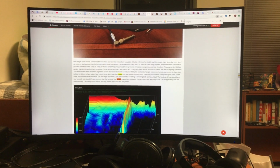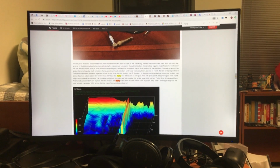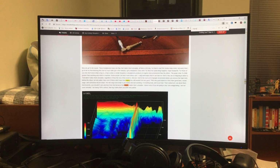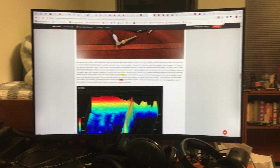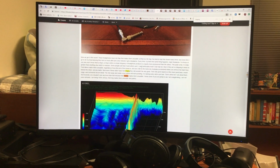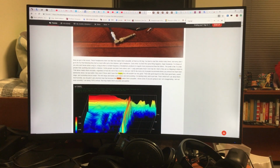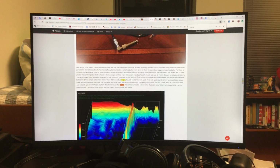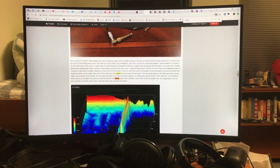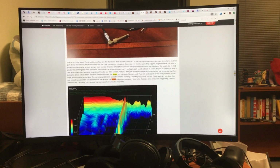This problem is very evident on HiFiMan's later offerings, like their HE400i, their HE400S, the Sundara, and the original HE400. Now, Audeze's LCD doesn't really exhibit this problem until they release the phaser model, which is the LCD-2 and LCD-3 phaser. Now, the phaser itself is not a problem, since it was released to correct the frequency overlap of the different segments of the driver, so that the frequencies do not overlap and form a distorted wavefront. The phaser itself is not the issue, but the issue is the driver tension.